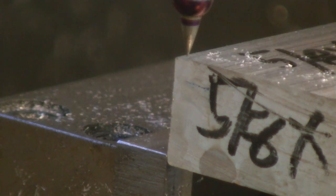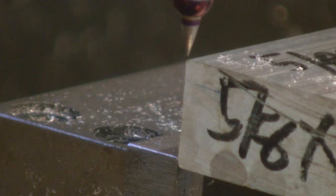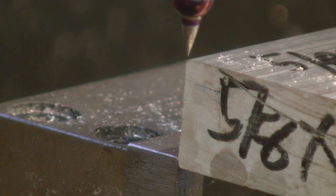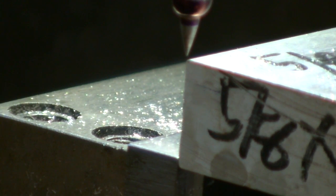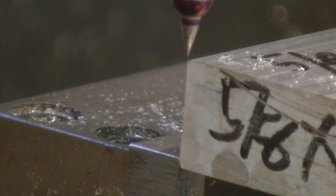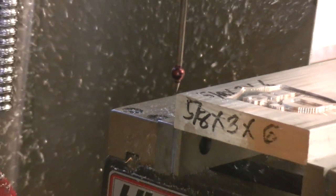This is using the point method now. You can get very, very close to being right on that corner. I'm going to set that at zero and change my jog mode. What I do is I come at it from a couple of different angles — I look at it from this angle, and from 90 degrees away. I'm still looking pretty good on my X zero. I'm going to call that XY zero. Using the wiggler, I'm able to pick up my XY zero — nice and simple.